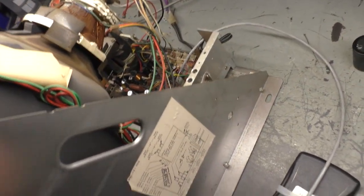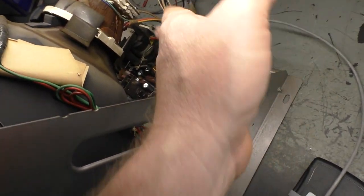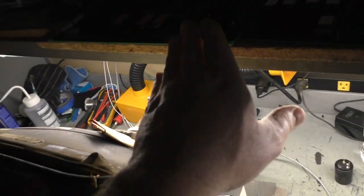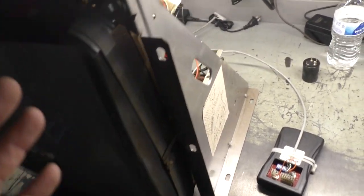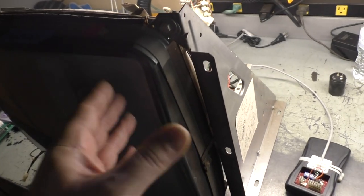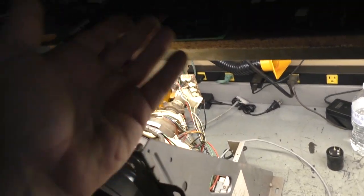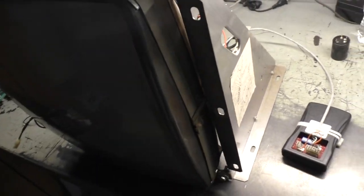It's not wasted effort, because this needed to be reflowed and rebuilt and capped and all that anyway. So this needed that, but the wonky image that we saw at the beginning is not caused by any of that. It was just simply the test board that I used was not jiving well with this sync signal and oscillation circuit, because that's why this board is a test board. So I'll show you here.